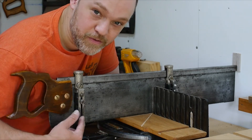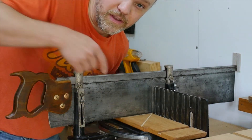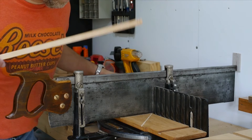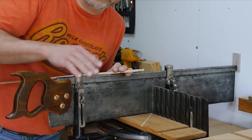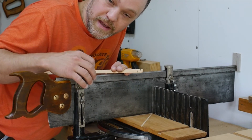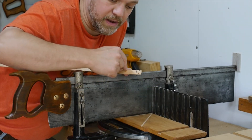It also has depth stops. This thing here is a depth stop — you can set it, and I've got it set right now where it won't cut all the way through the stock. The reason is I'm working on some kerfing, which is like a lining inside of a guitar that just needs a bunch of cuts. You can see right here where the cuts don't go all the way through. All you have to do is set your stops, tinker with it a little bit to get them where you need them, and then you can just go right along with your positive stops. You could put a piece of tape with a mark on it so you can index all along there.